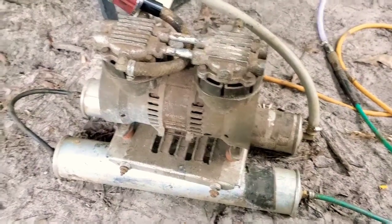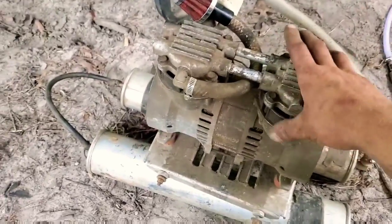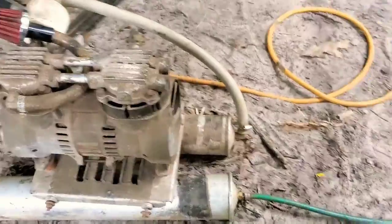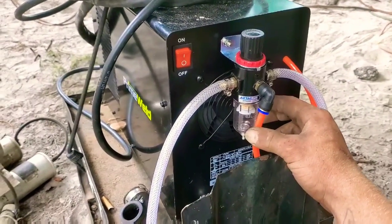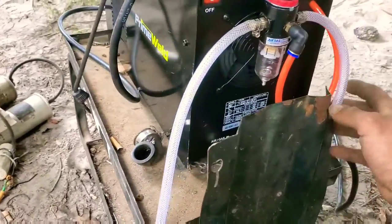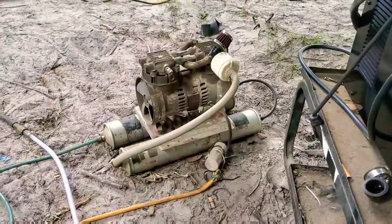All the stuff to make this is inside of the oxygen concentrator already. You just have to take it out, reroute a few things, and basically use the stuff that's in there to build this compressor, because it already compresses air inside the machine in order to give you pure oxygen. I just took all the little oxygen concentrator stuff out and made it where it's just a compressor and the two tanks, and then you have an output. Here's the output connected to my plasma cutter, and this is a water separator to keep moisture from getting inside my machine. I'm going to plug in the compressor and show you how fast the pressure builds up inside the machine.